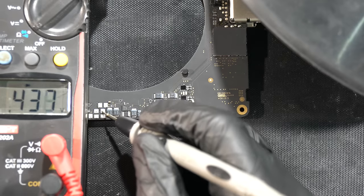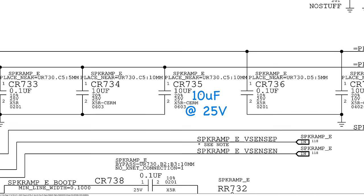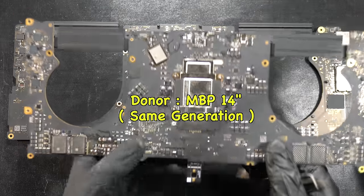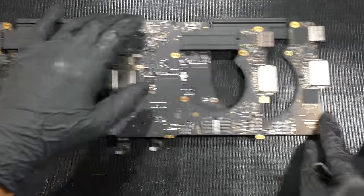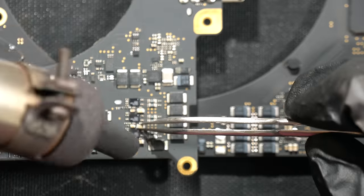Referring to the Flex BV board viewer, that component is a 10-microfarad ceramic capacitor for the speaker amp circuit — you can even tell from the explosion sign right beside the capacitor. Remove this capacitor using the hot air gun, then remeasure the PP_BUS diode value: 0.4 means the short is gone. Proceed to replace the 10-microfarad capacitor, sourcing the donor from the same-generation logic board, and transplant the speaker amp's capacitor to the target logic board.